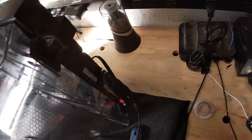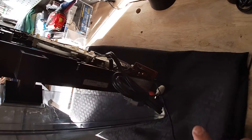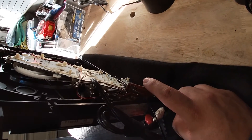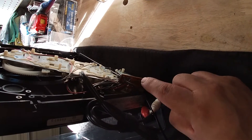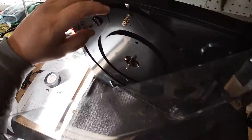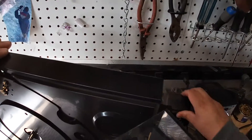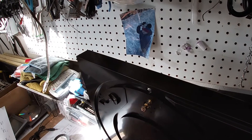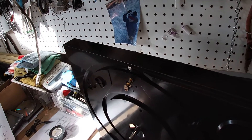It does have the correct polarity, which is good news. I crudely mocked up the power supply into the circuit board and put the circuit back in — hopefully it's working correctly. You can see the motor right there, and once I plug it in we get movement. It shuts off as soon as I put the arm back in the rest, and it starts running again. That's good news — that's showing me that this is potentially going to fix the problem of powering this thing. Now we need to solder these things on permanently and test for sound.